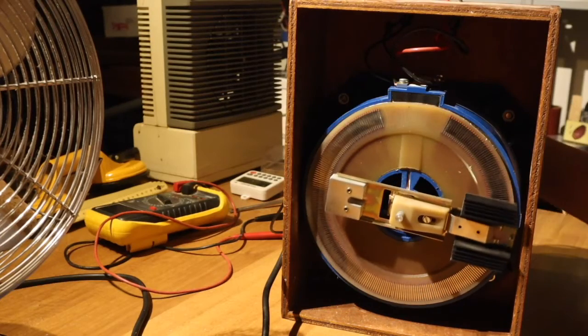The second method is to put a transformer between the normal grid and your fan. A transformer will give a perfect sine wave to the fan, so there will be no problem. I looked at Amazon for transformers from 230 volts to 110 volts and saw quite some negative reviews. But in the description I give a transformer with the right power to handle this fan. A fan will nearly always function at 110 volts — I tried it even at 100 volts using a variable transformer. If you put the fan at maximum speed, position 3, you can be certain it will work. This experiment was successful, so you can take that fixed voltage transformer.